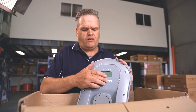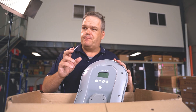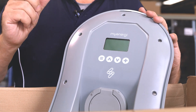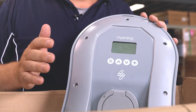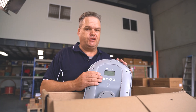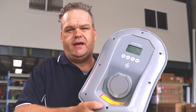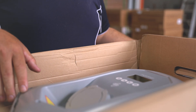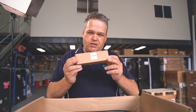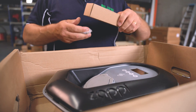Or you can go through Eco or Eco Plus mode to prioritise. In Eco mode you can say you're happy to take mainly solar plus top up a little bit from the grid if needed. Or Eco Plus means you only want excess energy that you're producing — only from renewable or green resources. They come in a single phase or three phase option and run up to seven kilowatts. If you get the three phase version of the Zappi charger, it actually comes with three CT clamps — so three of those get added into your meter box. You can even put a wireless CT clamp, which is their Harvey product.